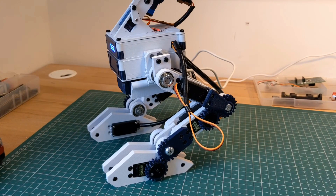The legs are controlled by an Arduino Pro Mini in the body, which is running a piece of code called a sketch that tracks the servo positions and also manages the minimum and maximum range of motion on each servo. Tracking the range is critical because if a servo were to overextend, it would impact another part of the model, which would cause damage to either the servo or the leg itself.